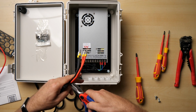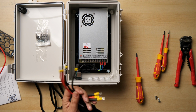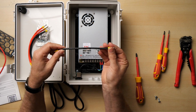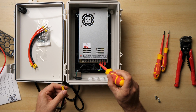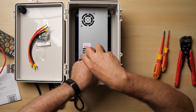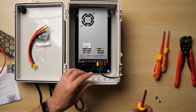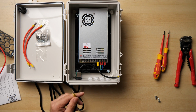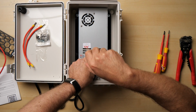Let's just get the little scissors out. There we are, and that's done the cable tie. Now we used 10 AWG cable in the build kits. Some people will say that's correct, some people will say it's overkill, but I'd rather err on the side of caution, and we know that Baldrick can pull 30 amps on its inputs, and so I want cable that I know is going to be quite happy at 30 amps. It's not going to start getting warm and causing us problems.